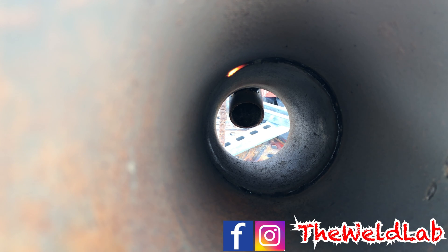This is the inside arch shot of the hot pass — I'm still running at 105 amps. Whenever you do your hot pass, this is the kind of color that you want to get: a nice cherry red. If your hot pass does not look something like this, it means you are running too cold and you need to crank it up some more.